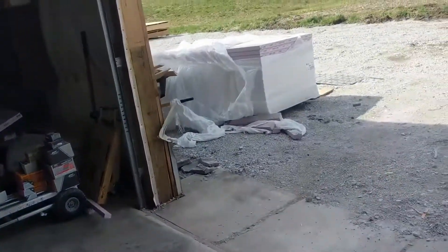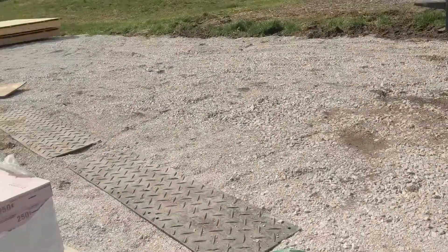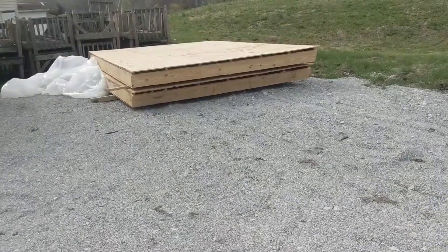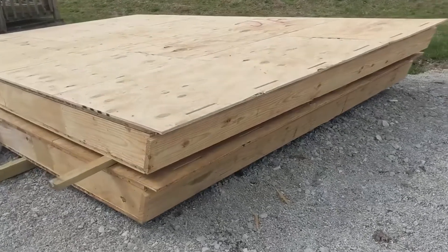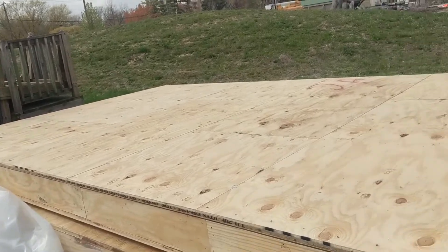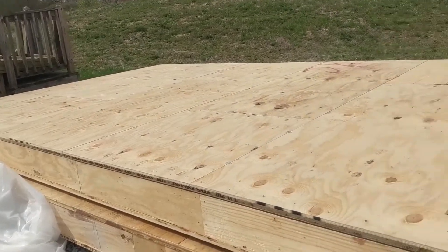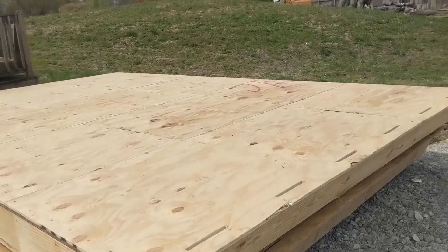Let's go outside and see the stack that we started for this latest set of homes we're producing. These are the finished roof SIPs. You can see the ledger board there on the front end that attaches to that beam. The decking is on already, R40 insulation. This is what is lifted with a small crane or lull onto your roof system after your exterior walls are finished, and it's attached to the main beam at the front. Then we install metal roofing on top of that.